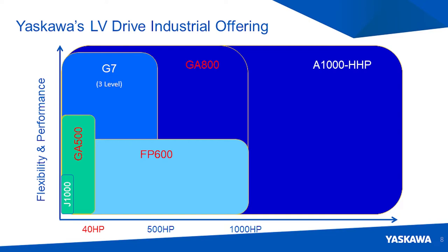The other thing about the V1000 is that in some distributed control, if you needed a drive mounted in a more robust enclosure type, we do have a V1000 variant called the 4X. The advantage of the 4X is it's a more robust IP66-style enclosure, capable of running in a dusty, dirty, even wet environment. That V1000 line is current and supports the same type of integration tools with RSLogix as the GA500. You've got a common hardware platform with the SI-EN cards, and then different architecture drives to choose from.